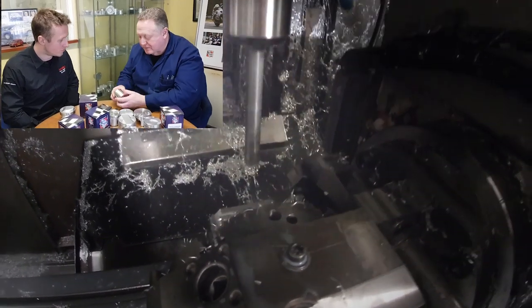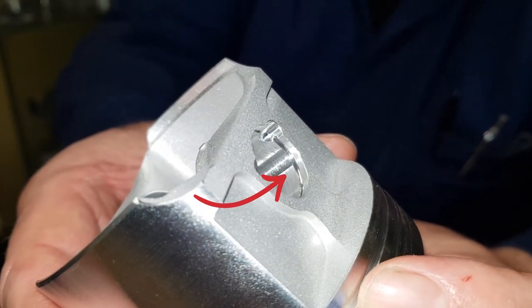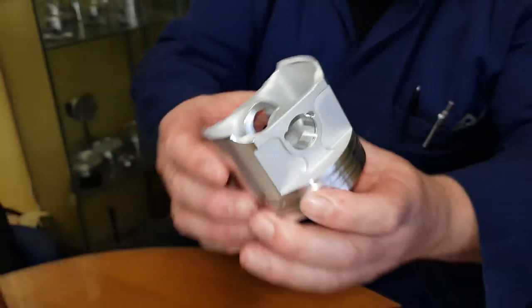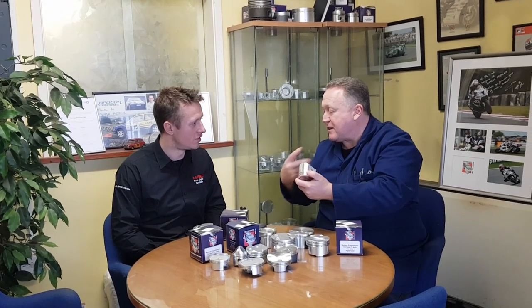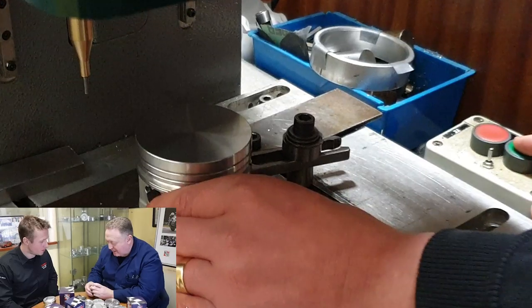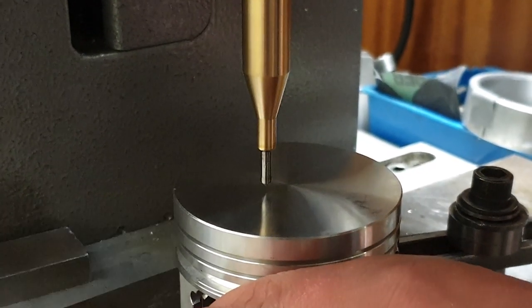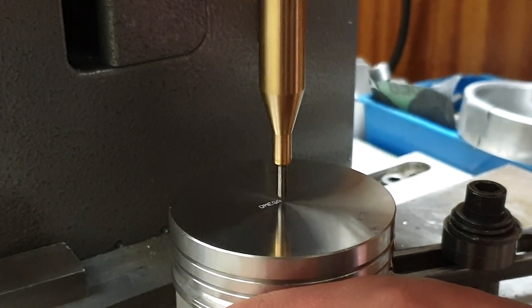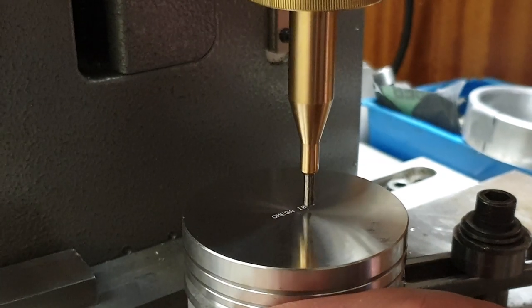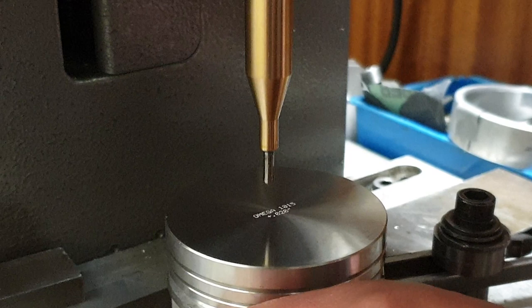These grooves — it's quite hard to see them under normal light, so we'll show you that with a flash. That's to retain any oil that's splashed up from the crankcase; it stays in there and lubricates the pin. And then obviously the marking on top is there for identification and traceability purposes. This marking machine has AutoSense technology — when it marks the piston, it comes down, bounces off the top just to make sure it's actually got the marking surface, and then marks it. So we can mark flat tops, dishes, and ones with an intruder.